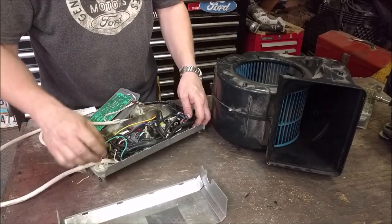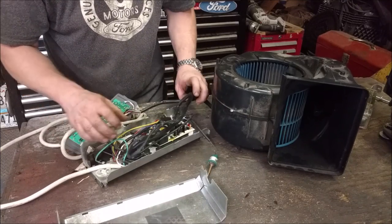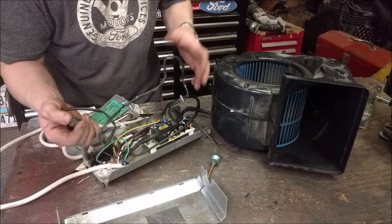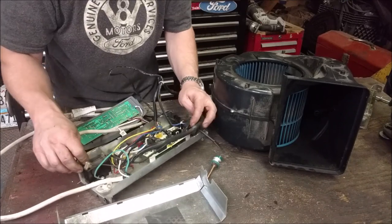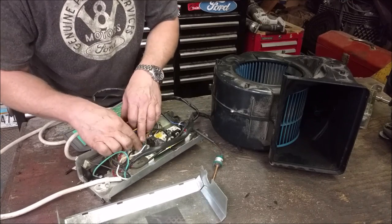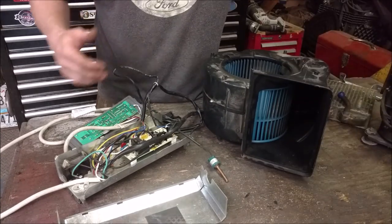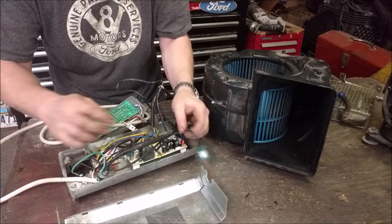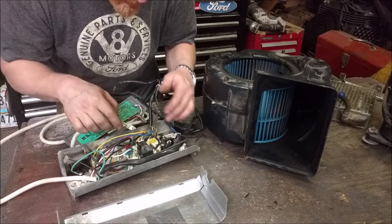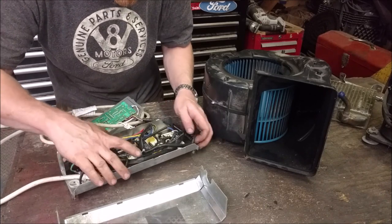We'll even open up the box here. This little switch actually sensed whether the fan was blowing with the AC on. Essentially, I think I only unplugged one or two wires off of the circuit board — the wires that went to power the compressor. That's it. Everything else is exactly how it came. All these units are pretty much the same. There's just a neutral wire and a power wire off that. I haven't touched anything else, so as far as this thing knows, it still thinks it's an AC system.